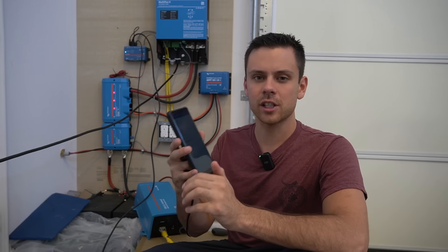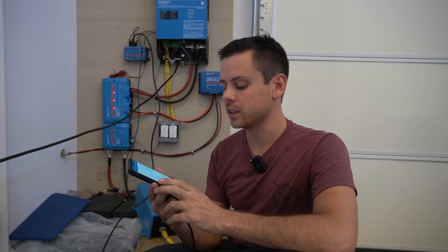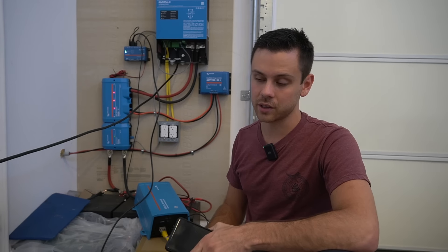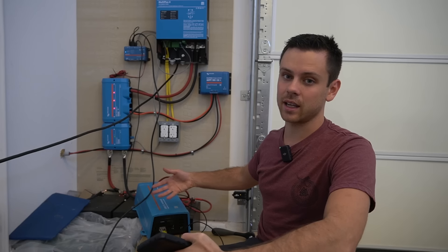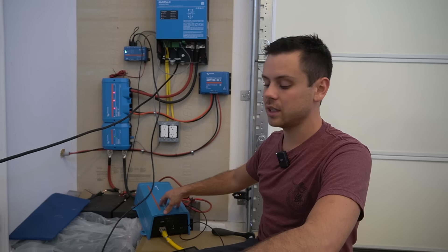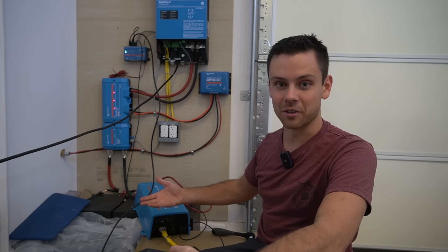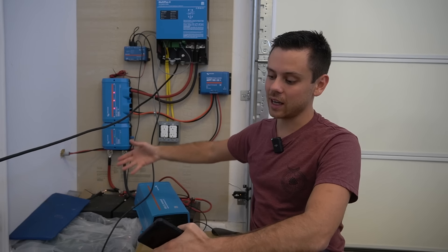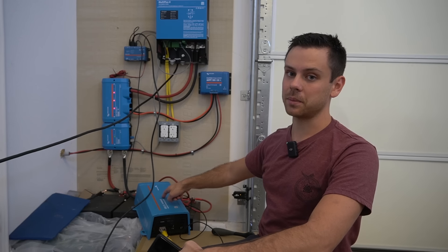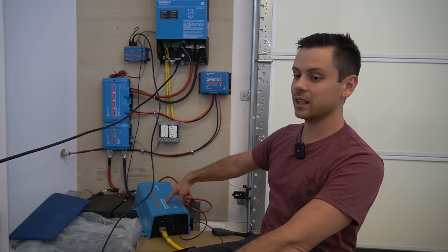For the low battery shutdown voltage, I'll link to a forum post covering 12, 24, and 48-volt lithium iron phosphate battery banks and the correct shutdown voltages. After running the air conditioner for about 12 hours, we're disconnecting it and connecting to the EcoFlow Delta Pros. These LF inverters are very reliable, especially a Victron — you should be able to run this load for decades. Note: we did not connect to the shunt for this test, just directly to the battery. If you're building this system, connect the Phoenix inverter directly to the shunt.